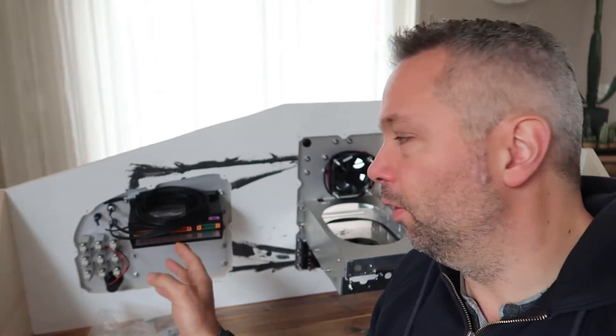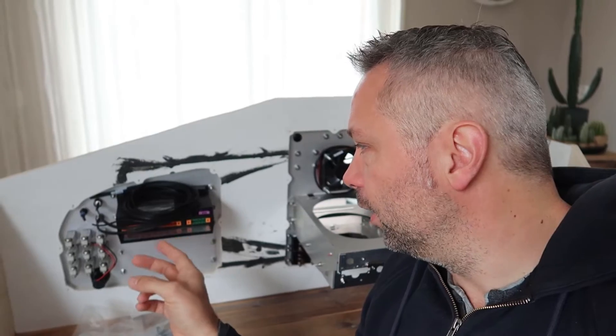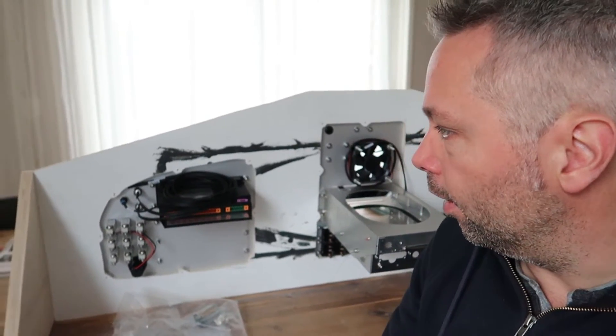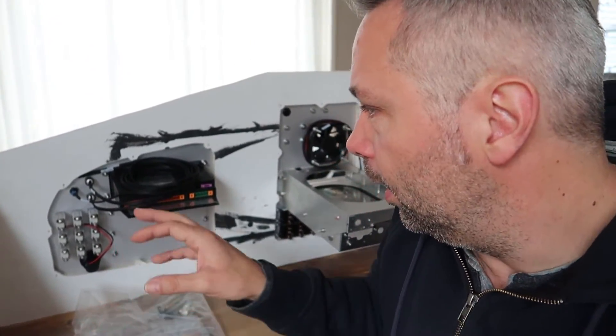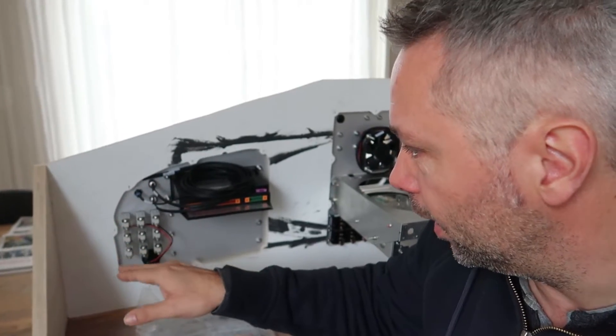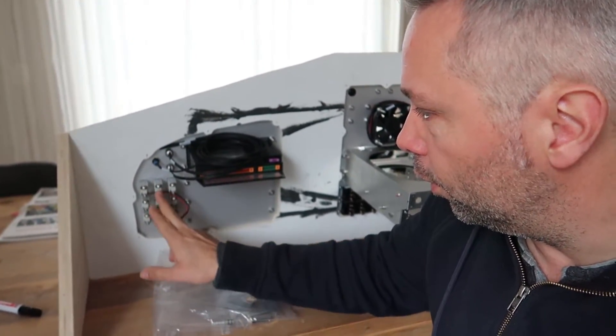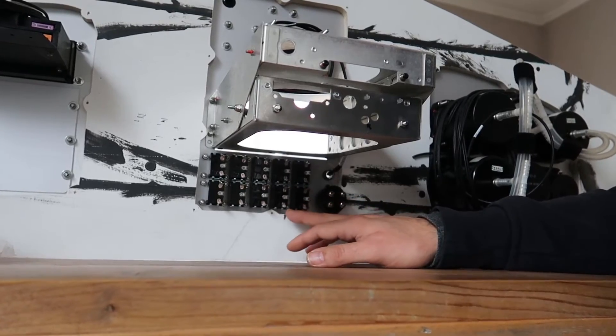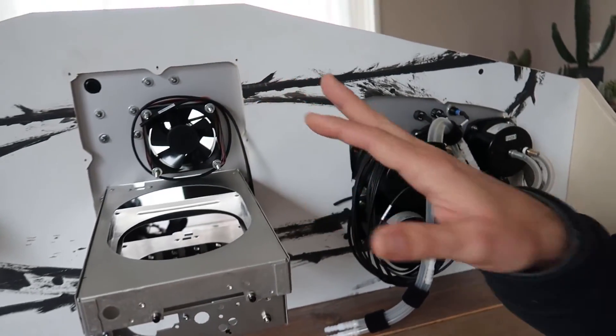On the right-hand side of the wiring jig is the right-hand panel with the engine instrument, which is pretty much already done since I left the connectors inside the airplane. We'll probably have to rewire the main power supply of the device. The wires here are for the push-to-talk button and the alarm LED indicators, and of course we've got the backside of the circuit breakers. The circuit breakers feed the switches and the switches feed all the separate devices — that's the idea, at least.